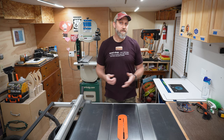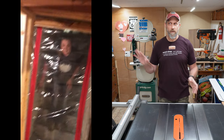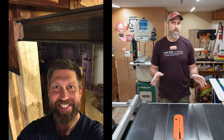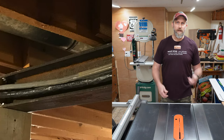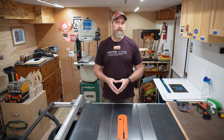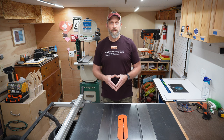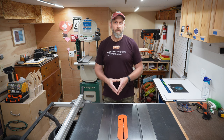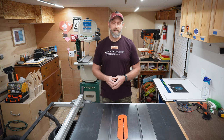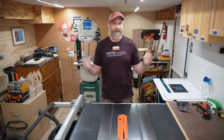When I bought this house, the basement was unfinished. The floors were bare concrete and some of the walls were bare concrete. There were some rooms built down here, but it wasn't really finished out. So I knocked down walls and put up new walls. I put in a subfloor in the whole basement — not just the shop. What that does is allow air to flow underneath the OSB subfloor so that vapor can dissipate up and through the walls. That's worked out really well. There is no musty smell in this basement. It's super dry and climate controlled.